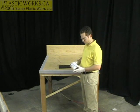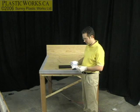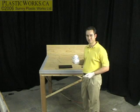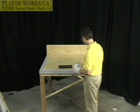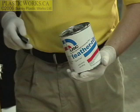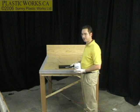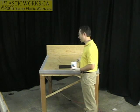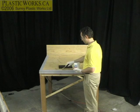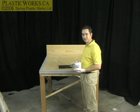One of the things I wanted to go over in this video is just the proper way to mix the filler. It's a little tough to explain sometimes, so I'm looking forward to the opportunity of doing a visual. This is just an auto body filler, lightweight, nothing too fancy about it, but it's pretty much exactly what you want for filling in cracks between the plywood, where the screws went in, where the flashing came over the edge. It's nice and light and easy to sand.